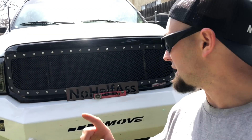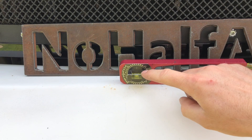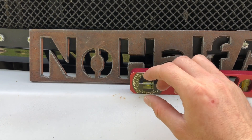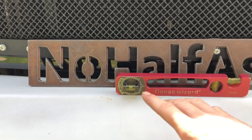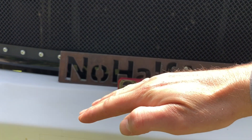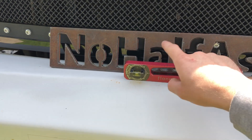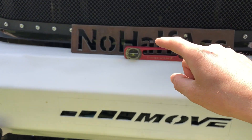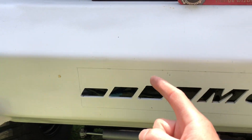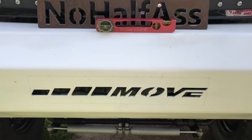I needed two hands for this and couldn't get it on video, but we did get our new plate marked up — or at least our cutout marked up. I used a protractor level to make sure it was nice and level on the bumper. This turns so you can put it directly between the lines. If the bumper and the truck are not actually level, you can level that out, and when you put the level on here and make it level, it matches. So we have our mark ready to cut out.